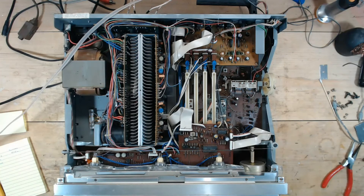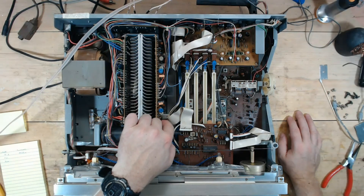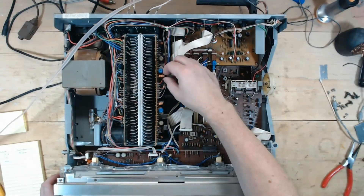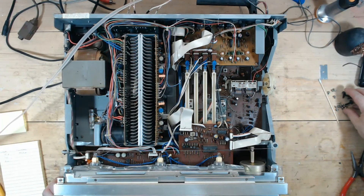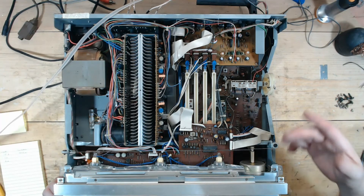As I pulled the camera away I reviewed the footage — I was getting 26 volts on that pin and it's supposed to be set to zero. I'm thinking one of these pots is bad. Anyway, this is going to be a long repair video. I just went through this whole thing with my 3900, and my 3900 came to me bad too.